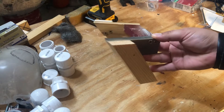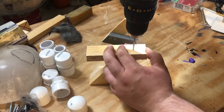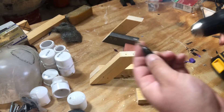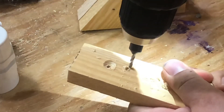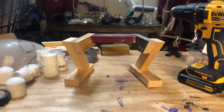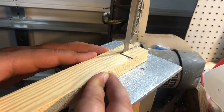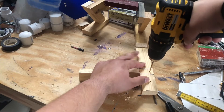Next I've got to start working on the frame that's going to be made up of 1x2s. I already started making the legs for this one a while ago, so I'm just going to use that. Then I drill some holes in them to attach the feet on, and I'm going to use this bit to create a bigger hole to countersink the screws, which will make them flush so that it doesn't wobble when it's standing upright. Next I'm going to cut some pieces for the spine and the shoulders, leaving them about 7 inches long, and I'm going to cut this piece out right here so I can attach the shoulder into it to make it sturdier.